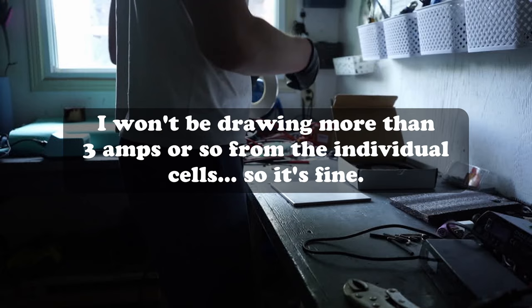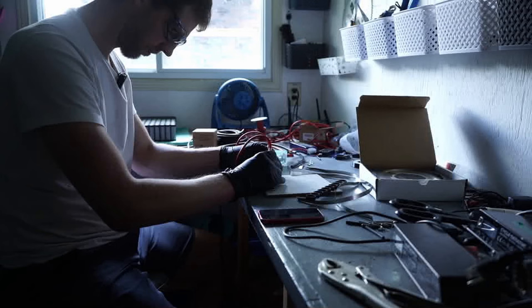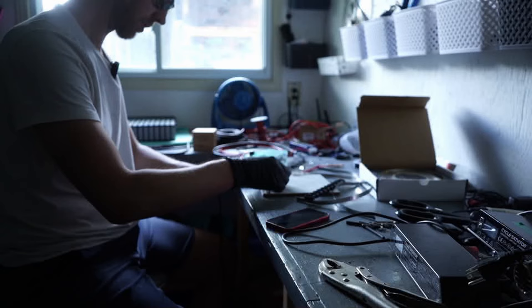This 8mm stuff seems so skinny. I'm using the K-Weld spot welder from Frank in Germany. What you see here is me testing different energy settings to determine what's going to give me the best strip-on-strip weld. First test at 60 joules — firm pressure. Still pulling off a little too easily for my liking; shouldn't be able to just twist it off that easily.